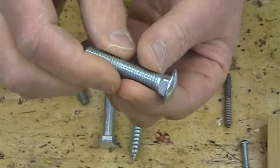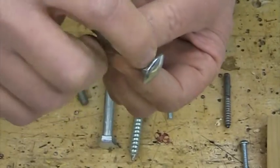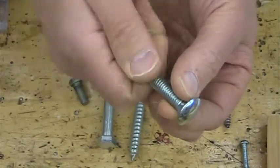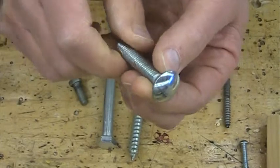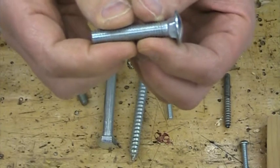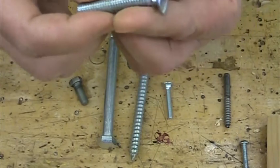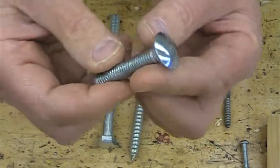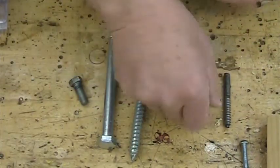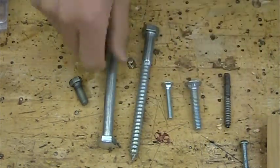You see this a lot on toys and other things that are assembled — gas grills and everything else you'd assemble. If they have a square hole at one end, that's for the square portion of the bolt to fit into so that when you tighten the nut, the bolt doesn't spin. It's not just used in woodworking. If you're building a deck, this is a nice way to bolt the deck components together. A bolt going through with a washer and nut on the other side is probably the strongest connection you can make to fasten two things together. So that is called a carriage bolt. So we have a stove bolt, a hex bolt, and a carriage bolt.